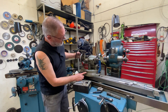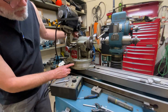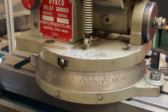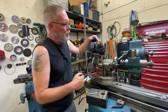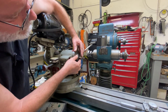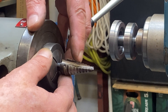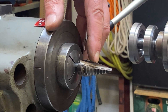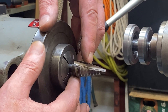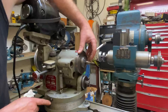I did all of my setup with this rotated to the zero position. Now when I actually grind this thing I'm going to back that off a half a degree. The reason is I don't want the flat portion of my grinding wheel grinding this whole surface at the same height — I want the leading edge to be slightly higher in diameter than the trailing edge. If I were at zero, all of this would be at the same height and everything behind it would be dragging through the cut. But if I make the back a little smaller, the front does the cutting and the back has just the slightest bit of relief so that whole back portion isn't dragging. It'll just make it cut a lot more freely, and I think a half a degree is just about right for that.